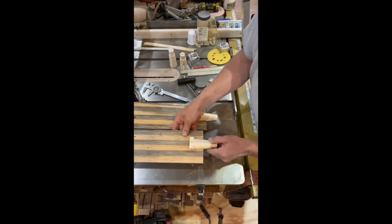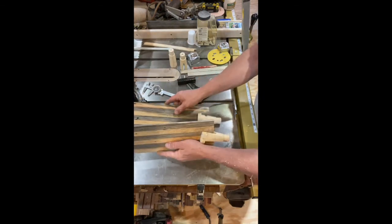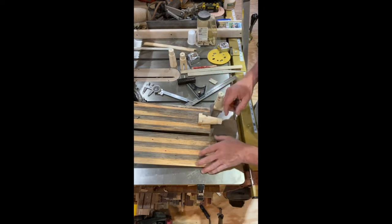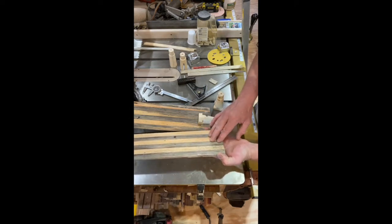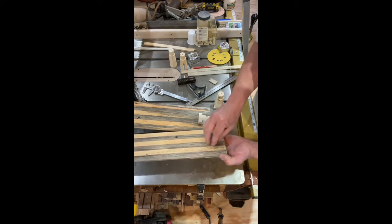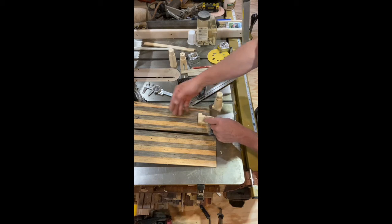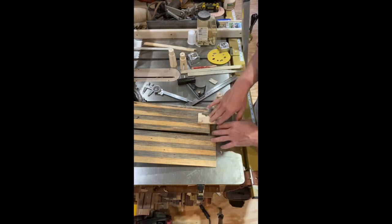The pieces are on and they seem to be fair. This one might be just a little bit loose, but once we get the glue in there that'll be fine. One of the things I need to do, since I epoxied these, is sand this area down so the epoxy can act as a binding agent. I want to scratch this area up a little more. I'll sand the rest of this and then put some fiberglass cloth on it — we'll have to taper this down first so the cloth comes up over the joint as well.